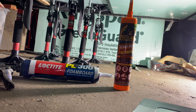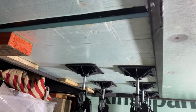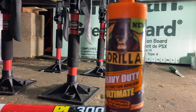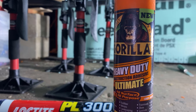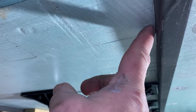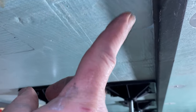What I'm doing is the first layer I'm putting up is a two-inch layer. But before I put the two-inch layer up, I use this Gorilla heavy duty ultimate construction adhesive — just how I'm doing it — going right against the subfloor, in between the subfloor and the frame, running a bead all the way around the perimeter. I'm pretty much doing that for a vapor barrier.